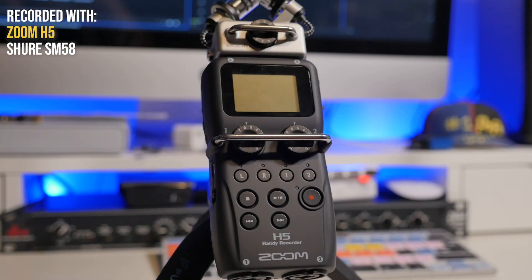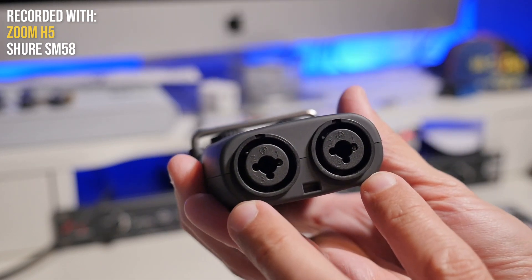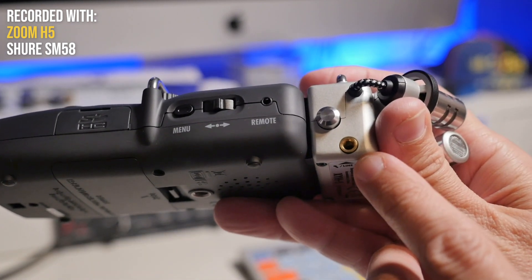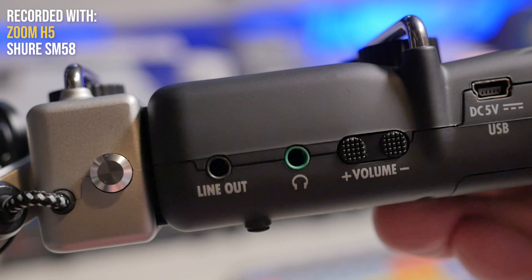Moving on, we're listening to the Zoom H5. This one's nice. The preamps sound good. The blue display, as opposed to amber, is much easier to read in daylight and in the dark. The external dials and controls make it easy to just pick it up, press a few buttons, and be ready to record. Build quality is very good. You have XLR quarter-inch, 3.5mm, and one-eighth stereo inputs. There's also a line out in addition to the headphone out — so you can run the line out to your camera and still use the headphones to monitor. You can power this via USB just like the DR40.